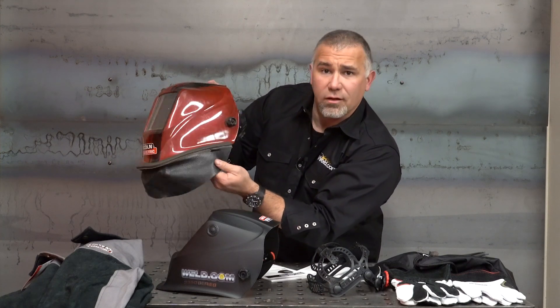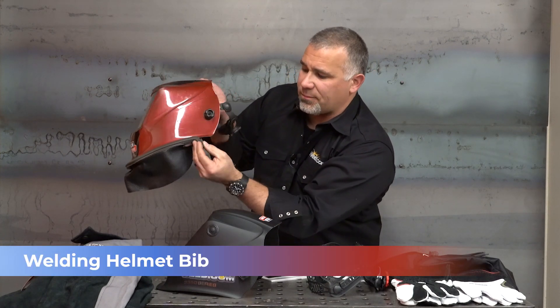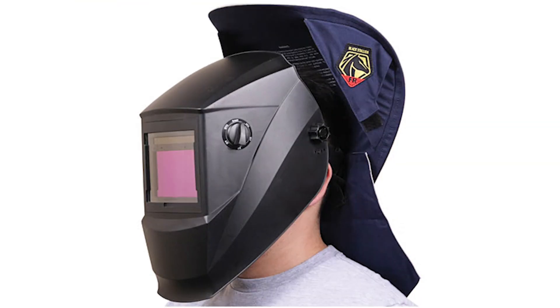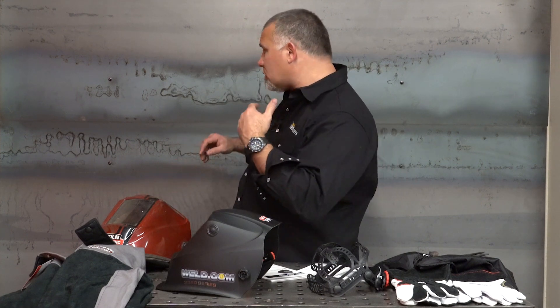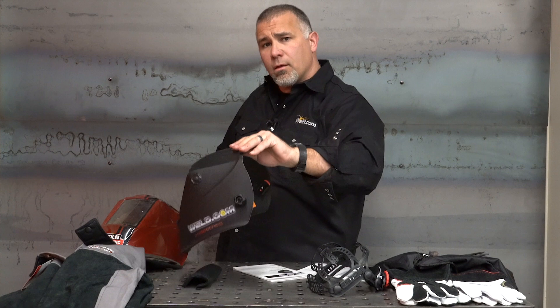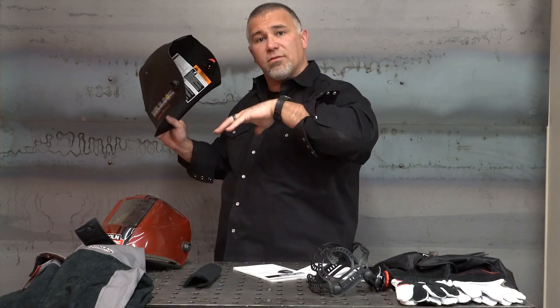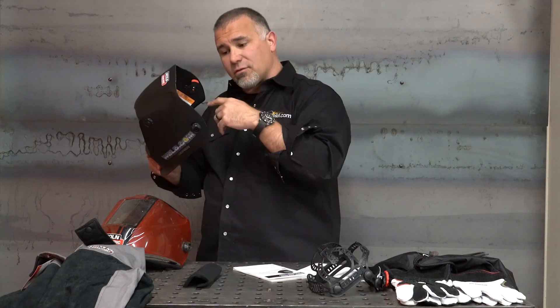Get comfortable. If it's dropping down a lot while you're doing work, you can throw on an accessory like a little bib that clips in along the outside of the hood. This helps prevent light or welding arc from getting up underneath your hood. If you're doing a lot of outdoor work or spray transfer, pulse spray, or really hot processes that are reflective and bouncing into your hood, they also have shields that go over the back. You'll see guys cut up a t-shirt and clip it on to block the light that comes in from the backside and bounces into your hood.